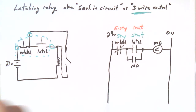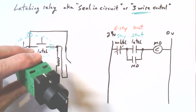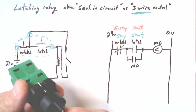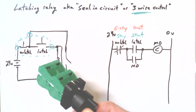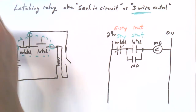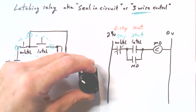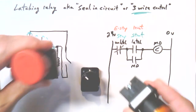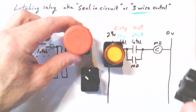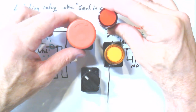Just getting, you know, you'll have your, I think actually we'll reset the motor. You can see on the prints, I'll have the ladder diagrams for you to follow. So you'll use the ladder diagrams to wire up what they show. And I think what we'll do is after we do the forward, off, and reverse with the fixed 3-position switch, we're going to maybe simplify that with just a 2-position that turns a motor on and off. And we'll use that on and off motor control, and we'll add a seal-in circuit with an Estop and a reset. We can have an indicator. I think I have an indicator on the portable trainer that indicates when the Estop's pressed, type thing.